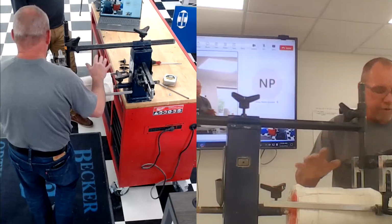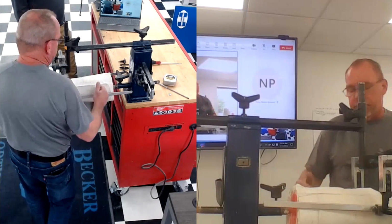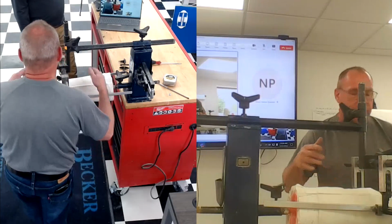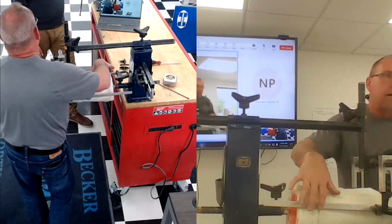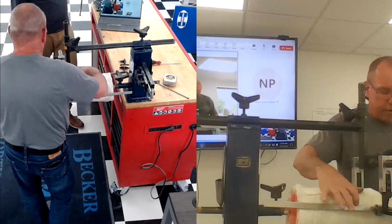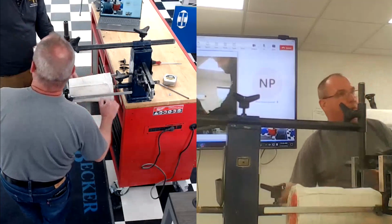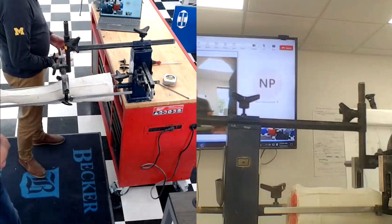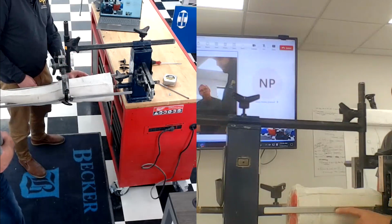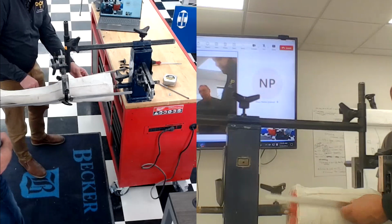There are a lot of different varieties of things that folks like to do that is their type of technical work, and that's great. When I get done with this and I have it contoured, I personally put Chicago screws into the plastic. I drill my holes, I mark my holes, I drill my holes while it sits on the mold. One thing that we didn't mention too is that before we're swinging, we always drill the holes in the proximal section after it's bent, and then we do the swinging.